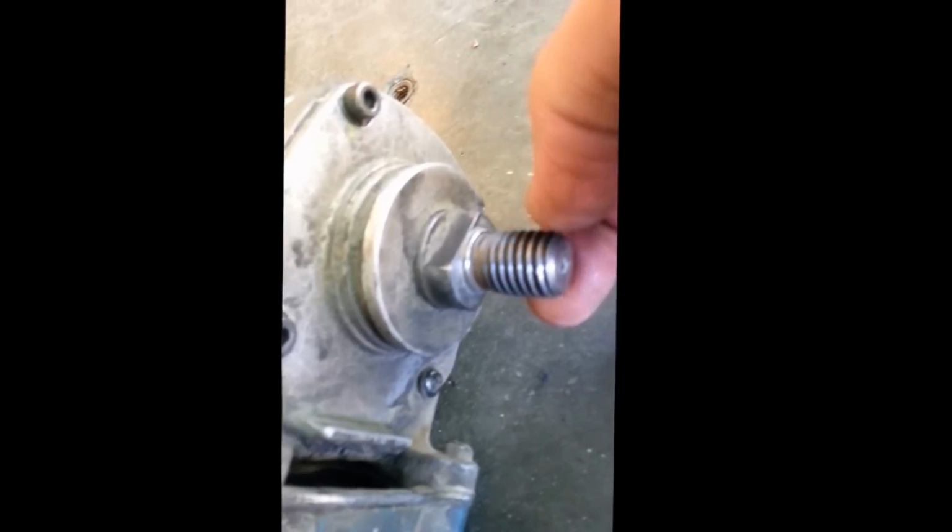Okay, well, we've machined it, and I've counterbored it slightly so that it'll fit over this little washer bump that's in here, so that when I tighten this thing up, it's going to tighten up against the flange. So that's the next step, is to start finding the center on the plate so I can put the pillow block in, drill a hole through there, and continue the build.